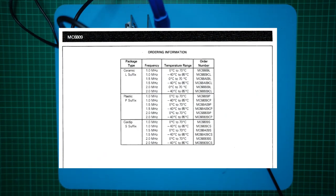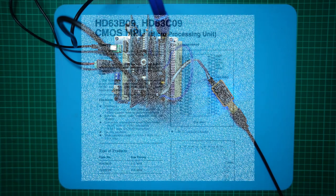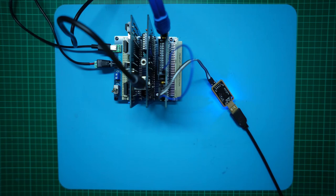The official rating of the fastest Motorola B speed grade chips. Noting that I do have some Hitachi HD63C09 CPU chips, all I had to do was get hold of a 12 MHz oscillator to allow a 3 MHz system speed test via the standard divide-by-4 clock.